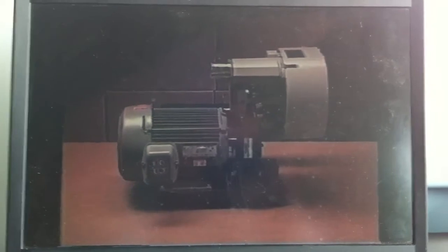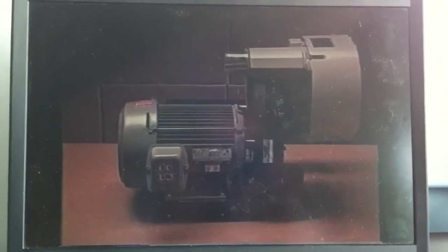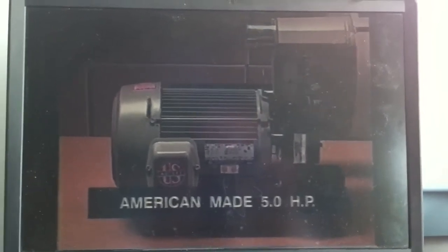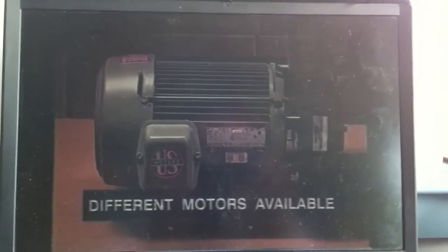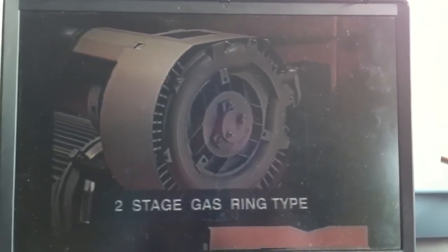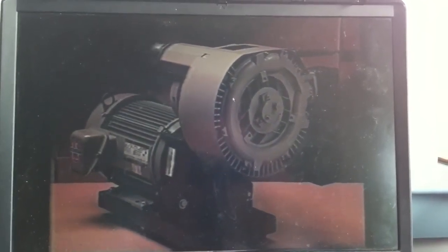Let's go over some of the technical aspects of the remarkable Vacu-Hoist. The vacuum pump is powered by an electric motor. The totally enclosed fan-cooled motor is 5 horsepower, manufactured in the United States, NEMA-rated, and UL-approved. Different motors are available in different voltages, as well as an explosion-proof model. The pump, with an enclosed timing belt, is a two-stage gas ring type. The pump can be placed up to 150 feet away from the load while maintaining full rating capacity.